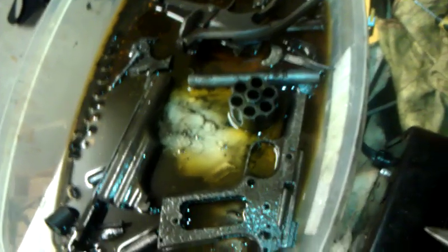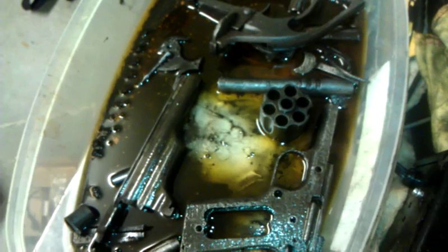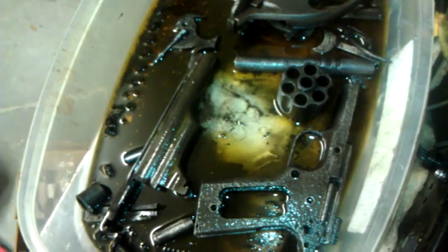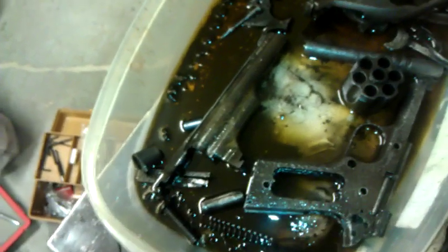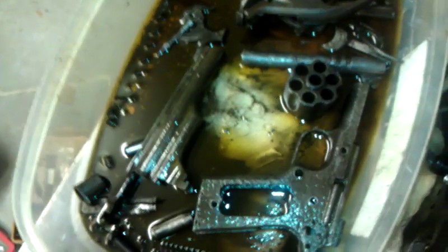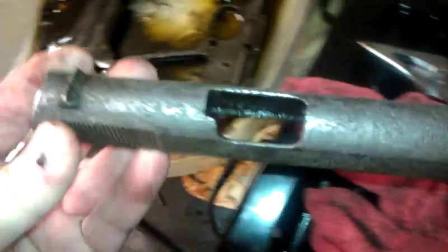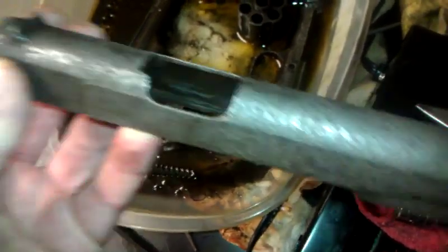There's still a couple of cosmetic parts that I'd like to restore — the plunger assembly for the front end, and obviously the main spring housing. I'd love to use the original, but that may require drilling, tapping, adding screws to things, pulling them out in vices, etc. So I'm going to put this back in the electrolysis to try to clean out that hole a little bit.